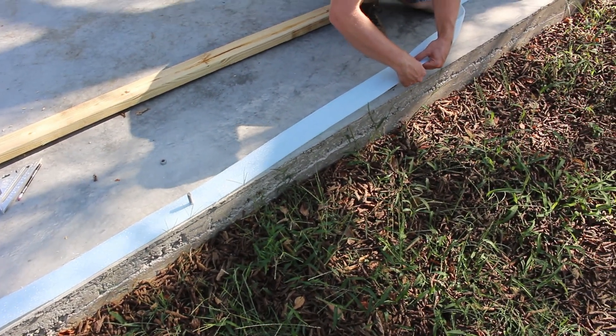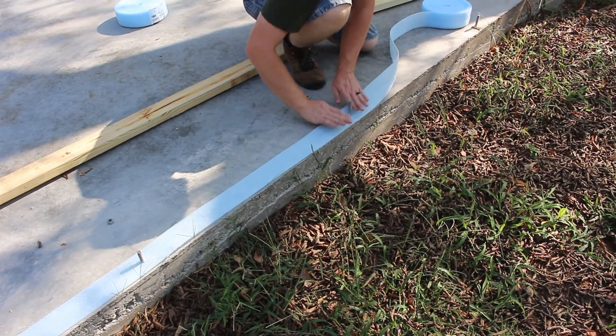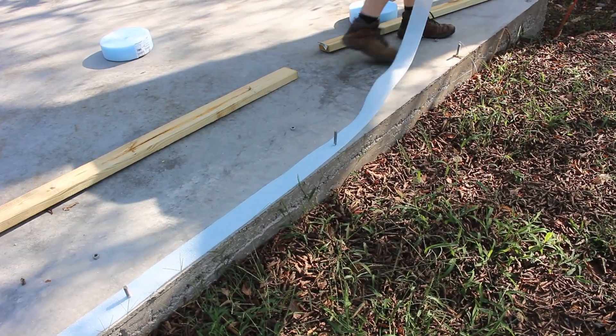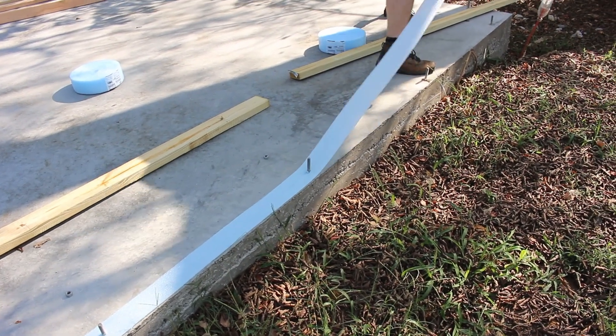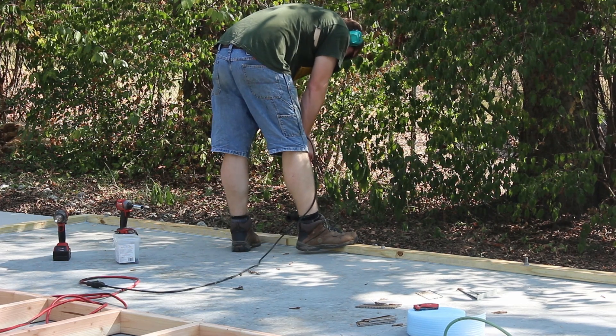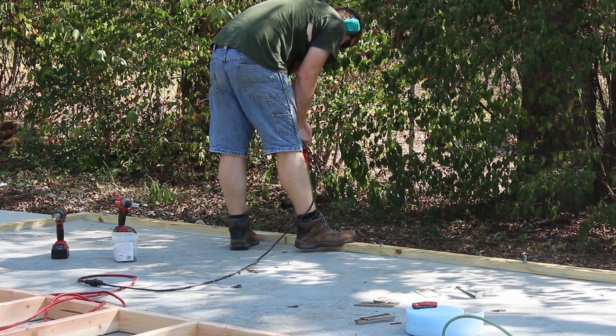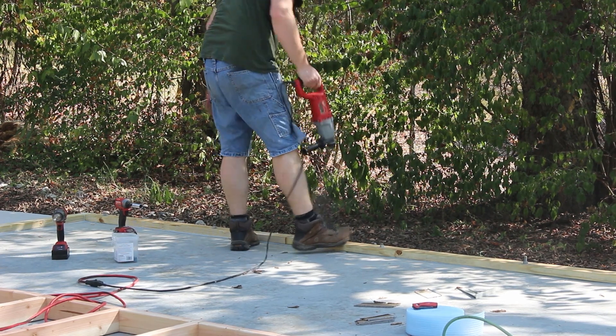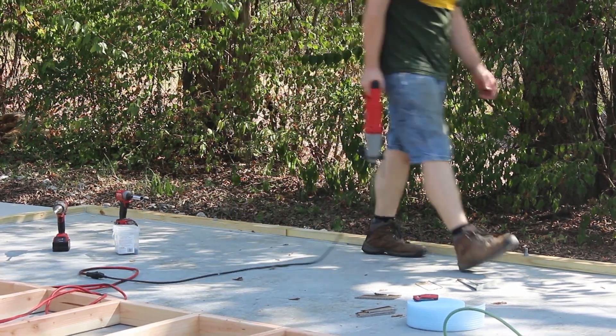The rigid gasket plate helps protect against moisture, which is worth considering if you're building on concrete. It also puts a barrier between your concrete and your wood sill plate. You could add acoustic sealant underneath that barrier as well. It's really up to you — I'm just sharing best practices from my own research and experience.